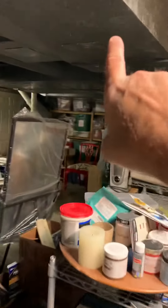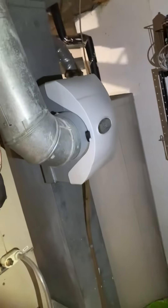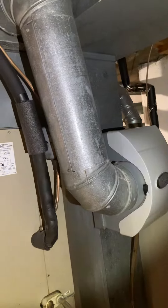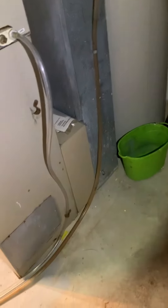This ductwork continues on and catches two ducts — basically two full joist spaces, right here and right there. She wants to reconnect the existing humidifier; she said she wouldn't even need one because it's her second floor and nobody's ever up there. We do want to reconnect it, not really worried about the valve — we're grandfathered in, so we'll leave that as is. Maybe we can connect the drain lines together and run them over to the floor drain.